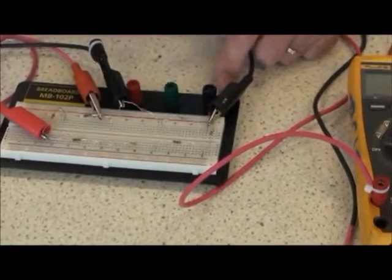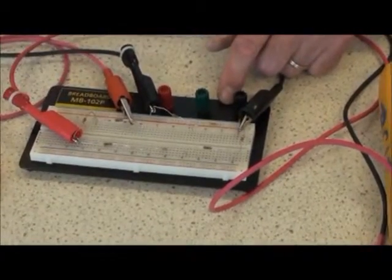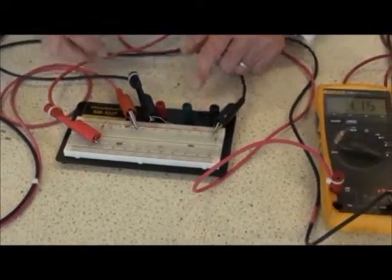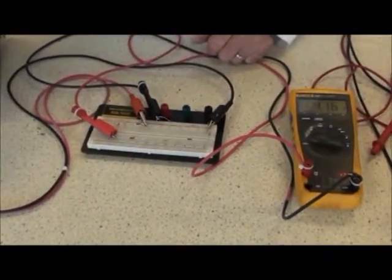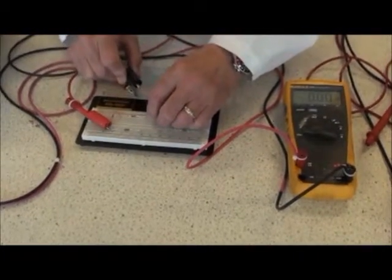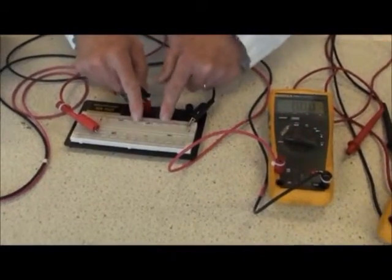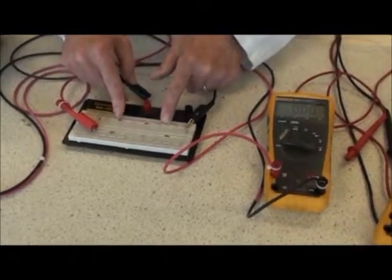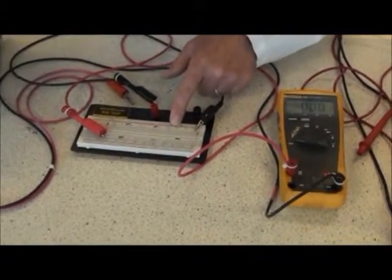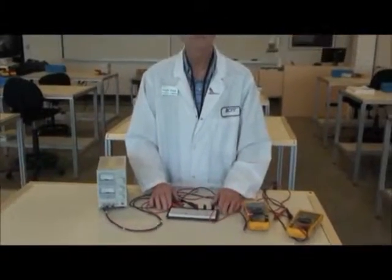4.15 milliamps through this part of the circuit, whereas I had a total of 10 point something milliamps as a total current. To return the circuit to normal, power supply off, remove the meter, and back on the proto board, and I could measure any particular point that I wished for current measurements. So that completes the measurement of current, voltage, and resistance in a simple DC circuit. Thank you for watching.